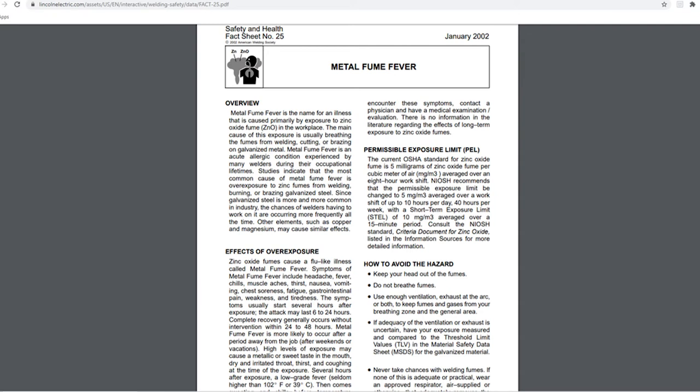All of this could be prevented and I don't want any of you guys to be in harm's way. The number one way to prevent this is to use a different type of metal for the nipple — I've seen most other videos using black steel. That's the best option: just switch out the galvanized parts and go with black iron. The second option I'd recommend is to remove the galvanized coating from the steel, which can be done a few ways.